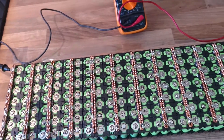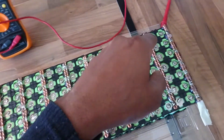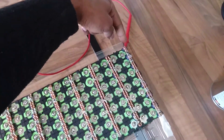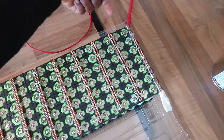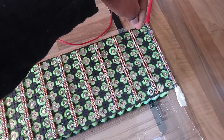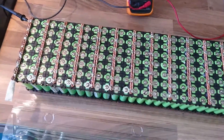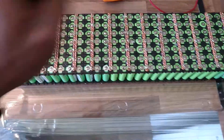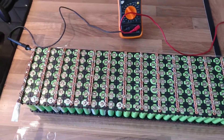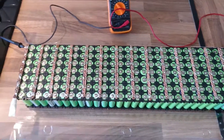You can still have cells facing down on both sides, so when you measure the voltage you have to connect the probe or wire from the other side where the positive is — you won't get an accurate reading if you just take it from the back of the cell. All this you've seen is almost 100 volts, meaning if I attach here and there I'd have 100 volts running through my body, which I would not want to test.